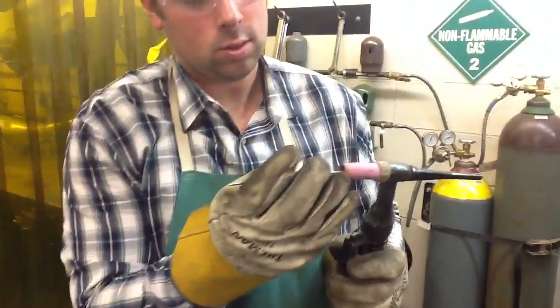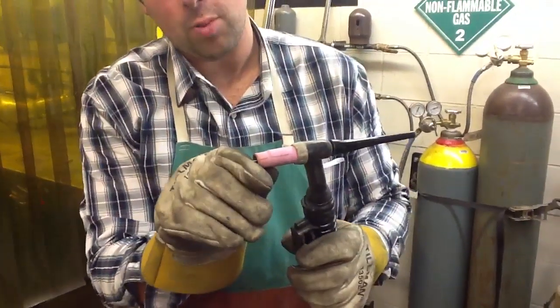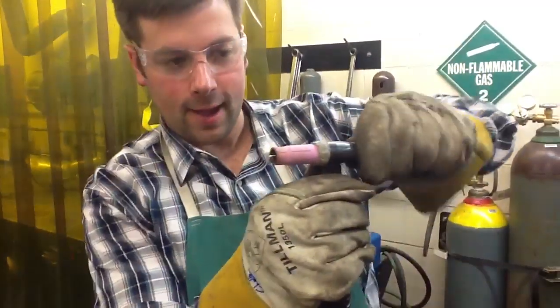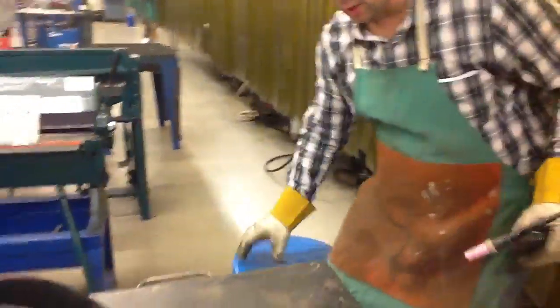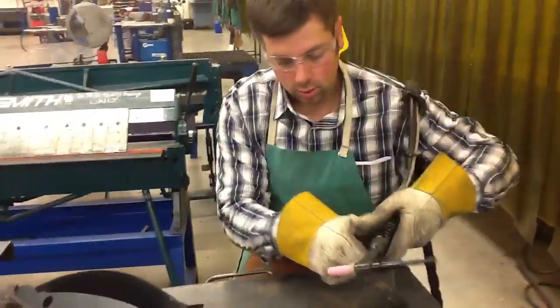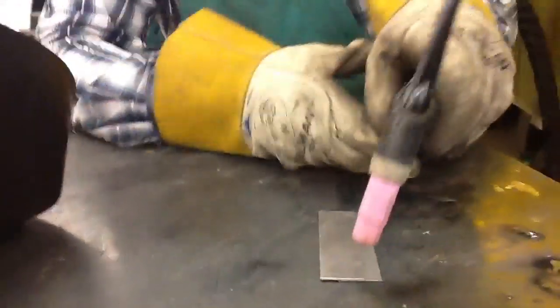Normally I want a sharpened tip when I'm welding mild steel. I'm going to pull it into the collet — the collet's loose right now. I want to push it in so we've got about the length of the diameter of the material sticking out, which is about an eighth inch. I usually leave it out a little bit further, about like that. I'm going to tighten up the collet — I'm good to go. I've already got some metal set up here and a stool so I can be comfortable. Now I'm left-handed, so I'm going to get my torch like this. I might throw the cable over my shoulder so I don't have to hold that weight up, and get myself in position so I can weld pretty much vertical.